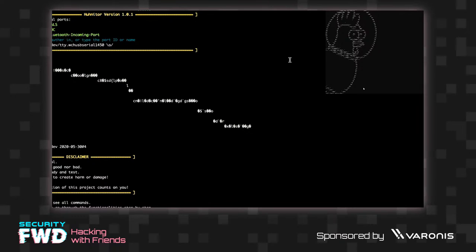Well, we would have to find the MAC address. And of course I can see maybe what network I know it's connected to, but there's a new feature built into this that I think is really cool, where we can basically use this little microcontroller to run a scan and then filter by vendor, which is awesome. So not to get too technical about it, but the way that this works is the first half of the MAC address is set by the vendor, and you can look that up to determine the manufacturer of the device, because they have to use that first part of the MAC address, because it's their assigned space to label their products with.